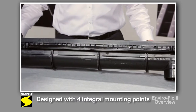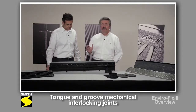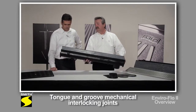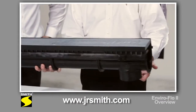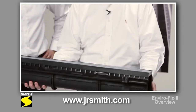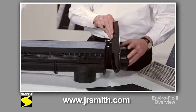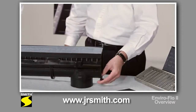We've done something totally different about the joints. We've made the product as user-friendly as possible. There are no more screws, no more clips to assemble the system. It's based on a tongue and groove design, and on the male end there is a locator pin, and on the female end there's a hole in the bottom of the channel for the locator pin to go in. So when you assemble them, they're in perfect alignment. We've done the same thing with the closing end caps and horizontal outlet caps, following the same principle — they slide on and the locator pin keeps it in position.